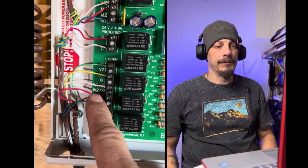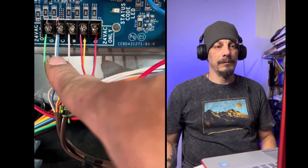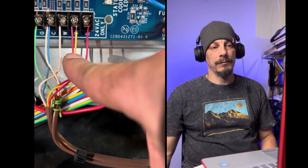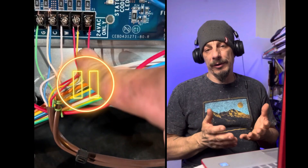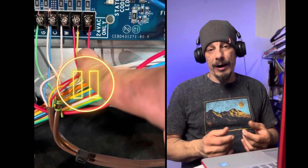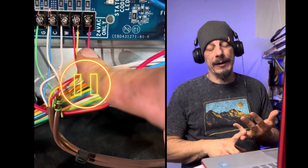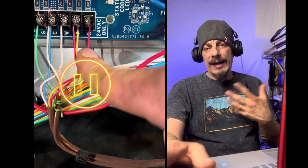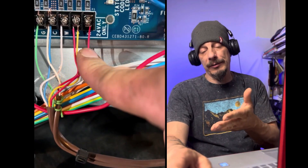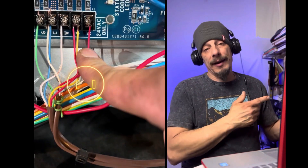All the connections going to the furnace get wired in below. It's normal wiring: green for the fan, blue and white for common - the white is coming from the condensing unit - white for heat, red and yellow for cooling going out to the condensing unit, and red for power. This particular unit had an evaporator coil, so it was a furnace with air conditioning. We had two common wires because one common goes out to the condensing unit to turn on the outdoor unit on a call for cooling and has to return to the board to complete the circuit. The red wire connected at the yellow position sends the signal to the condensing unit to pull in the contactor, and that white wire on common completes the circuit.